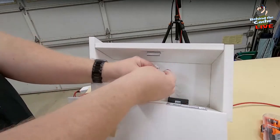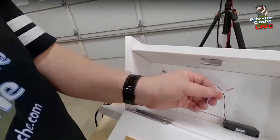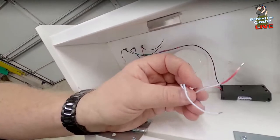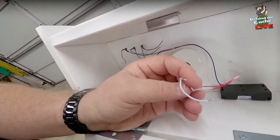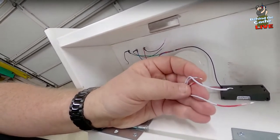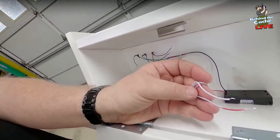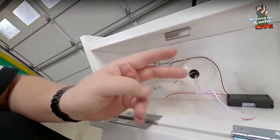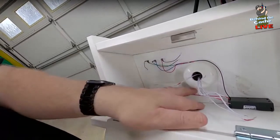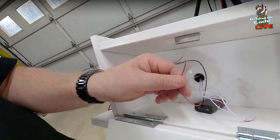So that's good in place. The next step — I hope you can see this — is that I've marked some of these wires with red. Those are just one side of each of the reed switches, and that's just for my reference. So I'm just going to grab all the red ones on this one, put those together, and then run all of those — the red ones — into the red wire and use a solder sleeve to put those into place.